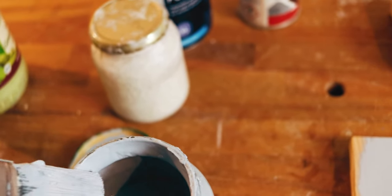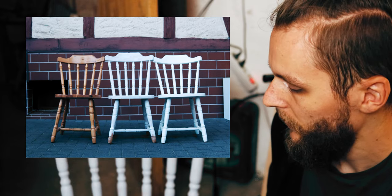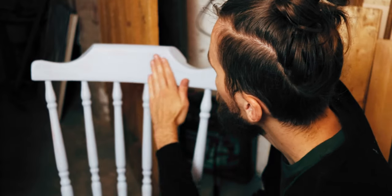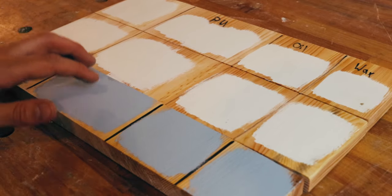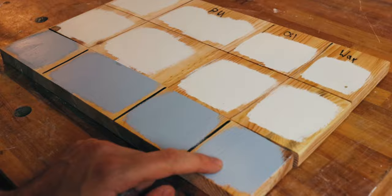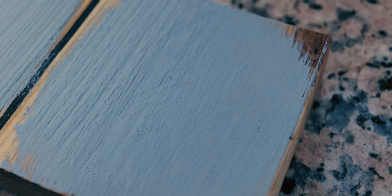This paint is much thicker. With just the first coat you get good coverage on all the different surfaces. You can also see it on these chairs — previously they had a clear coat of acrylic paint on top, and I immediately started with no preparation work using this DIY chalk paint. After the first coat you get really good coverage; actually only a second coat is needed and you're done. On PU this DIY chalk paint is working really great. But on the oil and the wax, the thick DIY chalk paint causes some cracks to form, especially on the wax. A thinner paint gives better coverage on those surfaces.